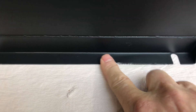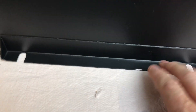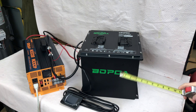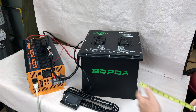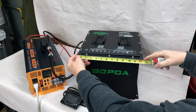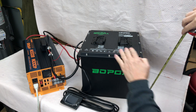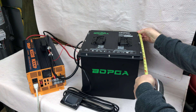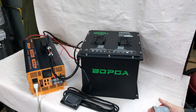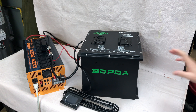With a little bit of work with the hammer I was able to straighten out the mounting flange — that's real stout material but it hammered out nice and smooth. Now for measurements, because this is one of the unique features of this battery: it's 12.5 inches wide, 10.5 inches tall to the top of the plate, and about 13 inches front to back. Just over one square foot — it's the smallest 51.2 volt 105 amp hour battery I've ever seen.